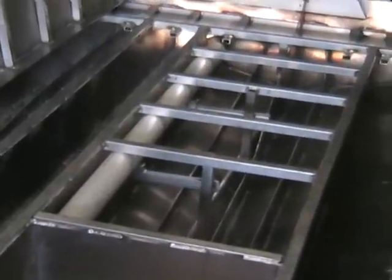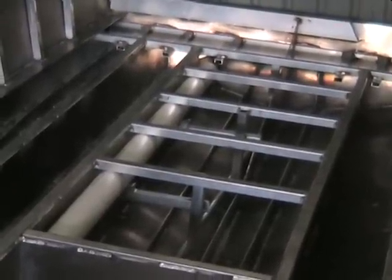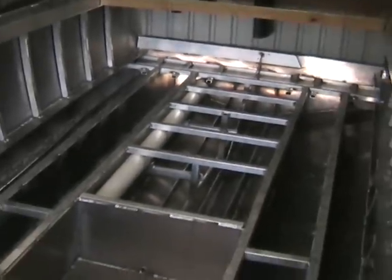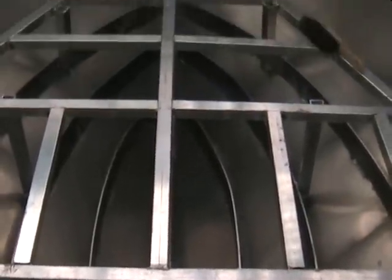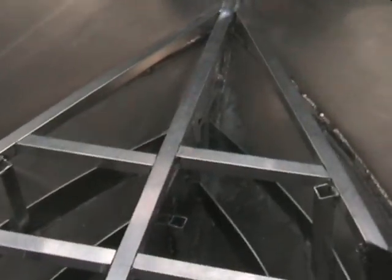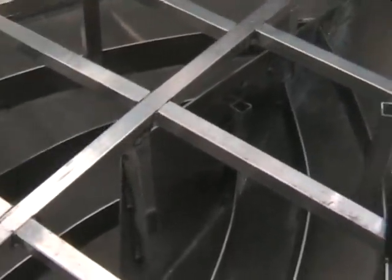The PVC pipe there, because it's a centre console, all the steering controls and stuff will run down through that and up under the console from the transom panel. The horizontal bulkhead in front of the fuel tank void, that's exactly 2100 to the knuckle where the chine meets, up there. On the other side of that bulkhead, there are 100mm stringers all going up to a big bracket on the keel, which gives it heaps of strength if you ever punch a rock, so you won't cave the front in.